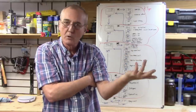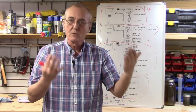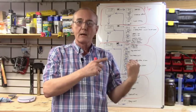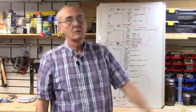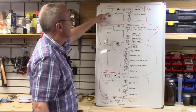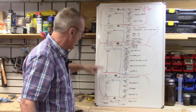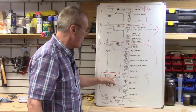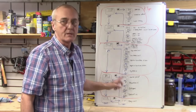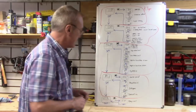At any point if something goes wrong, push set and hold it for three seconds to go back to the beginning. Or just set it down and wait about 20 seconds — it'll automatically return to the original screen. You're not stuck if you make a mistake. You can also skip to a specific chapter: get to IP, push set instead of the arrow to jump to OP, then ALP, then PID — opening just that chapter. But once you open the pages you have to go through them all before it returns.